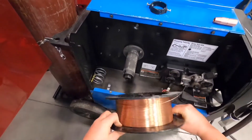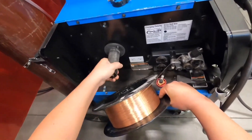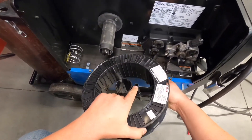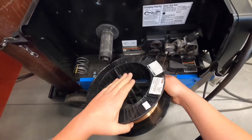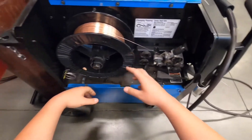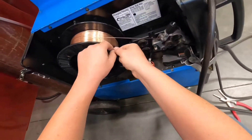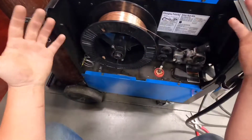On this post we have a tension knob. It holds the spool back so it doesn't unravel itself — but only if you line up that tension post with the hole on the spool that's designed for it. Whether it's a wooden, plastic, or metal spool, most will have a spot for that tension knob. When putting on a new spool, students often get in a hurry — the wire is tied off at the end, and if you just undo it, clip the bent hooked part, and let go, you can end up with 40 feet of wire unspooled.